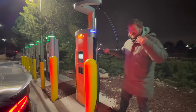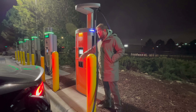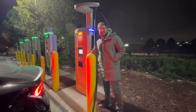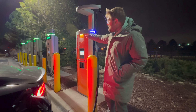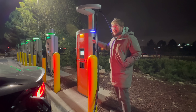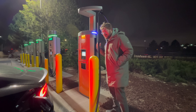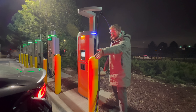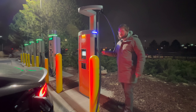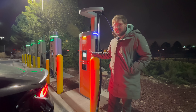These can be configured in three different ways: a single CCS output like we have here — which is my preferred method — two CCS connections, though I don't believe it allows simultaneous charging from the same dispenser, or a CCS and CHAdeMO. In a station like this, there's no CHAdeMO car on sale that could take advantage of the power this thing can output, so whoever specced this charger made the correct decision to go with just one cable. These liquid-cooled cables can be $12,000 to $15,000 or sometimes more, so I think they made the right compromise.